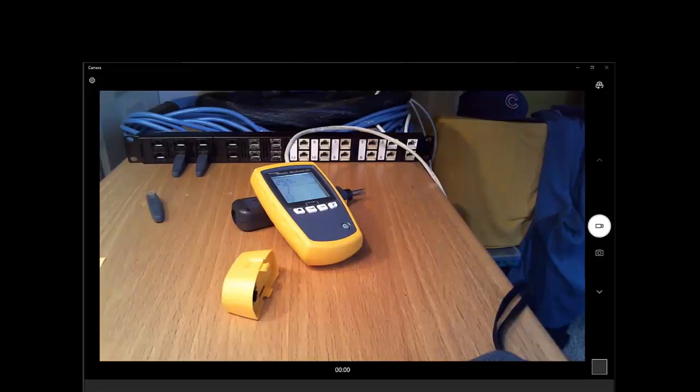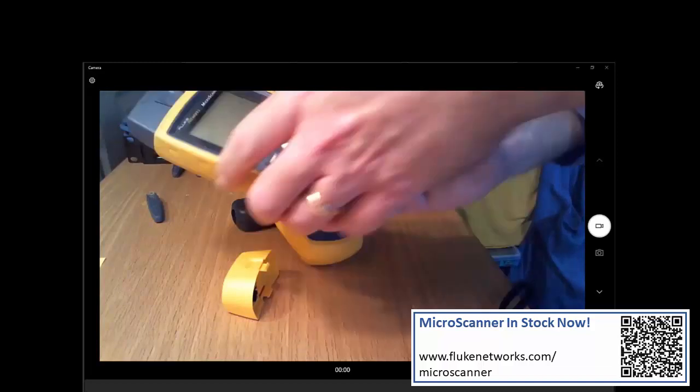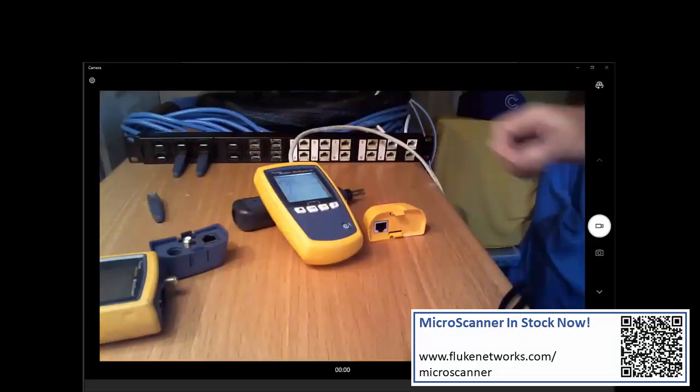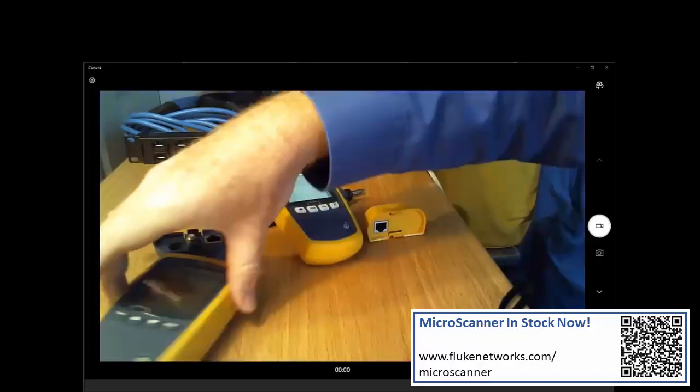So if you've got something like a camera where you want a lot of bandwidth, a high resolution camera, you want to be able to see that and know that you've got enough bandwidth to support it, or an access point as well. If you're putting in a Wi-Fi 6 access point and you're expecting to get 5 gigs of throughput out of it, and you find out the connection is only a meg, you're not going to get that throughput that you wanted. Oh, look at that. There's a comparison, Jim. That's perfect.